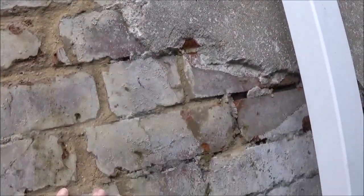Please bear in mind, if you're doing a proper footpath or a proper driveway, please put down the correct sub base. So I've cut my three sides out of my little quadrant box, and I'm going to go and connect that up to the drainage. Then my drainage will start in that centre point and work backwards this way and work out that way. And then I'll have to cut the two ends down to size. Using just a standard wood saw, I'm going to cut through the plastic. So there you have it — the plastic bit's cut down to size. I'm going to leave the metal grill to later and I'll cut that down to size when I'm finished, using an angle grinder.